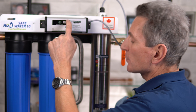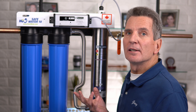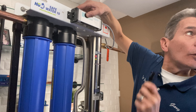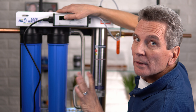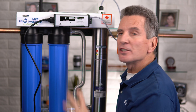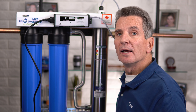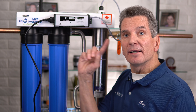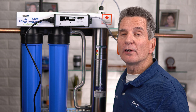Now we need to fire up the system. After 11 months of use the ballast starts beeping to tell you it's time to replace the UV lamp, but once you've replaced it the ballast doesn't know that until you reset the timer. To reset: push down the button and don't let go. While holding the button, plug the system back in — you'll get one long beep, then three short beeps. Count to five and then let go. Count how many times the red LED flashes — it should flash 12 times if reset properly, meaning it will be 12 months before it reminds you again. If you don't get 12 flashes, the system probably wasn't in alarm when you replaced the lamp — I'll put a procedure in the description below explaining how to handle that.